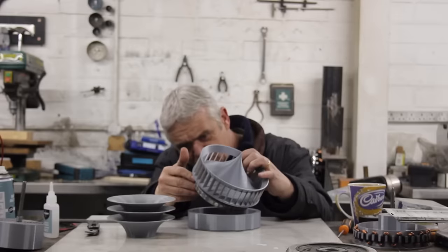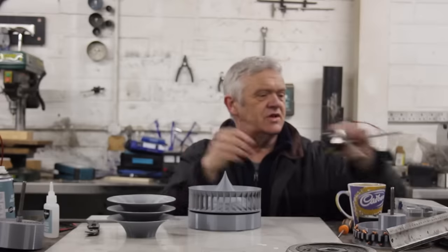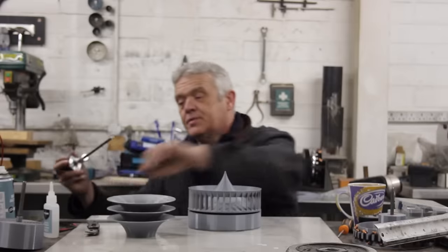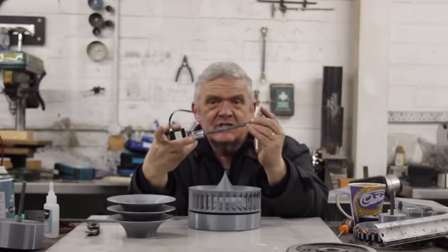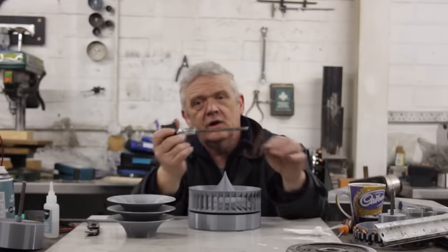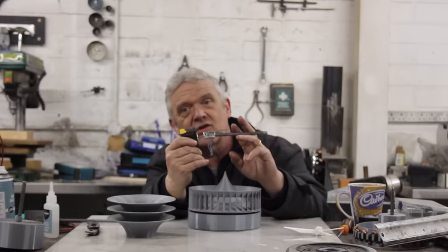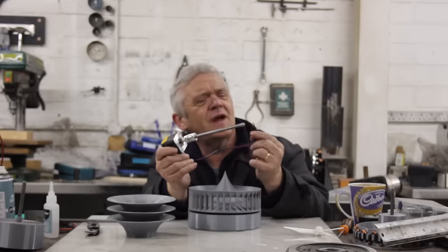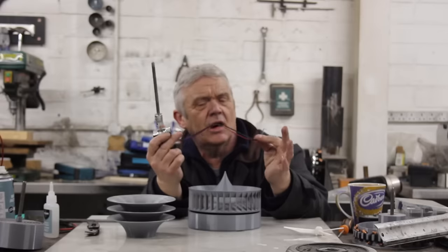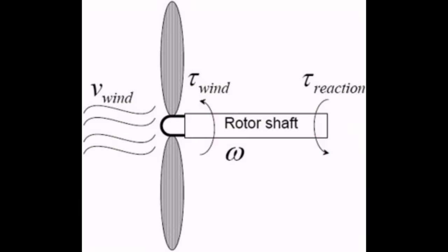Taking the generator separately is a bit harder because it's integrated into the device. If we had a propeller on there, we'd measure the torque produced by the propeller. To evaluate the generator, we'd measure the power produced with that given torque. Measuring volts and amps only tells you about the generator or the combined device — it tells you nothing about how well the turbine itself is doing.